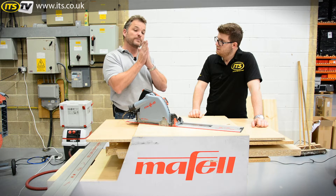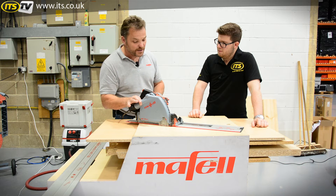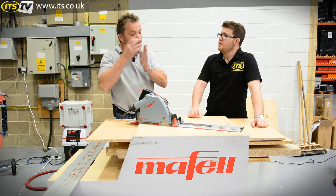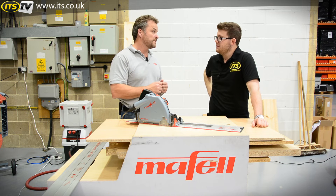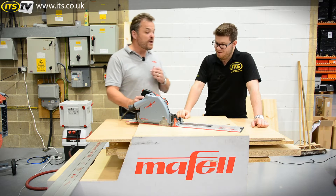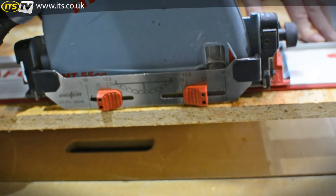More importantly, it draws the blade into the body of the machine by 0.1 of a millimetre — one-tenth of a millimetre. So when you do your second cut, you flip the switch and the blade moves back out one-tenth of a millimetre. As the saw tooth is coming up, it is one-tenth of a millimetre away from your material — it can't shatter the edge because it isn't touching it. That means you can cut kitchen worktops, laminates, guaranteed splinter-free, first time, every time.